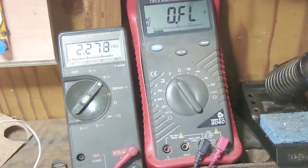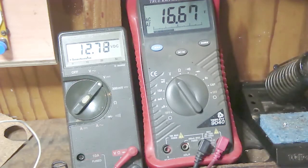And we're off. I had the DC side clipped on the wrong side — I had it after the resistor, I wanted it to be before the resistor. Here's the variac voltage on the right, and then the voltage from the selenium rectifier on the left. Let me just keep bringing it up. The radio is turned on, I do have an antenna on it. You see the difference now? The DC voltage is significantly higher, which is a good thing.